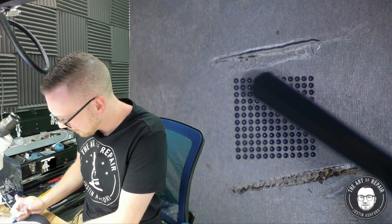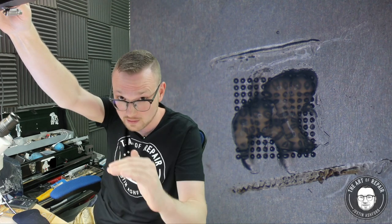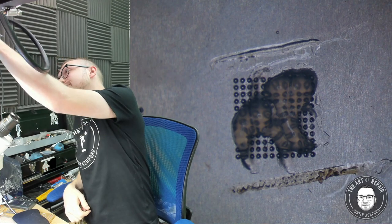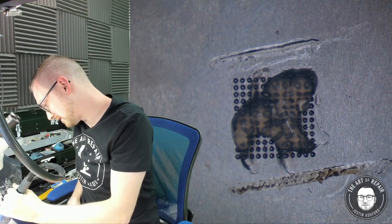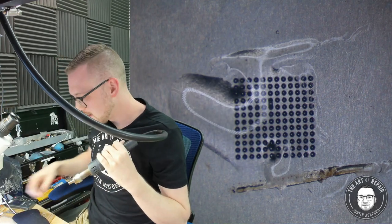Give it just a second, then put a little bit of new flux. We want to be careful because IC chips are fragile. I'm changing my hot air station to 140°C — that is well below solder's melting point, especially 63-37 which melts at 183°C. At that lower temperature it's not going to melt anything, but it will loosen and lubricate it with a little flux. Hit it just a little bit and you'll see the paste is melting and going down into the holes. Then flip it over.